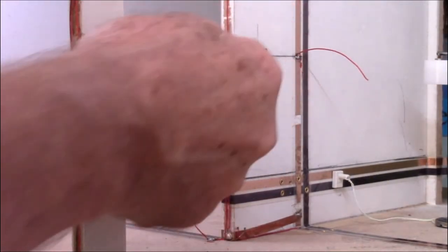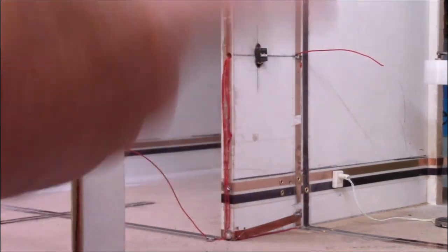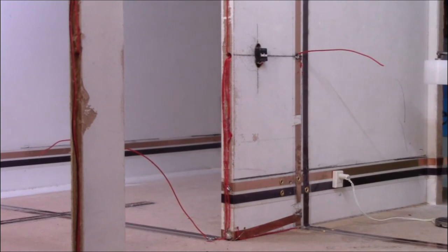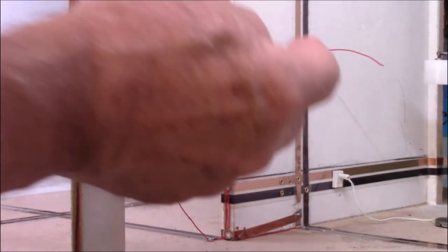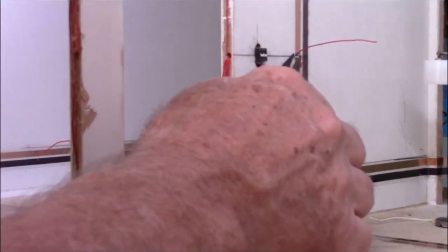So I've pulled all of the wires as tight as I could from every place that they came out, and then pushed it in place, put some glue on the back of it, and set it so that it would be good and straight. Did the same thing on the other side so that both of those are in place and soldered. I then have a bunch of wires that were coming out of the hole here, and we had the one that came over to the back side here. I have taken each of the leads that we needed to. I brought that one over here, pulled it through the hole, laid it across the red wire connection on the flat tape, soldered it in place, and we can cut off this little tail.